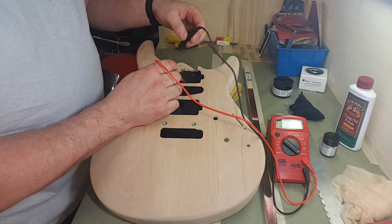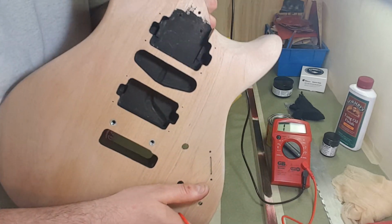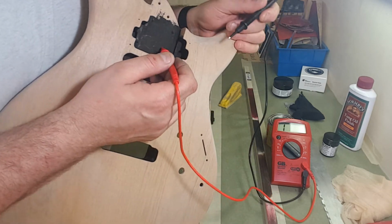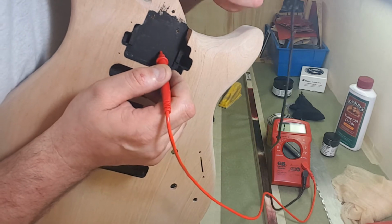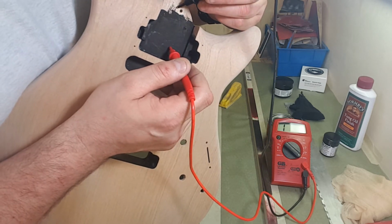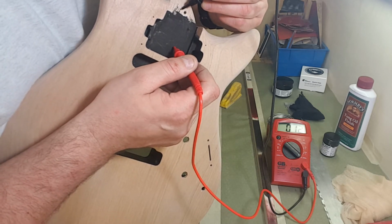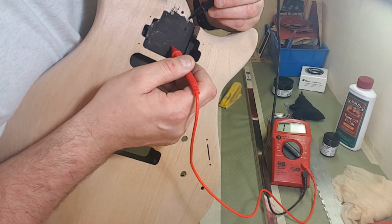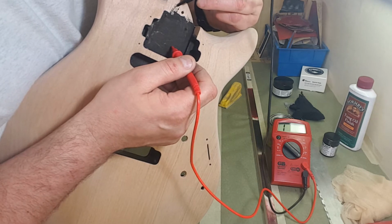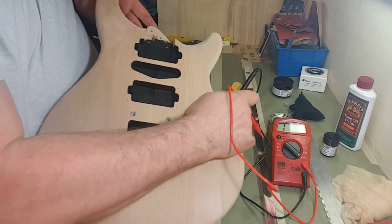And just to prove that this stuff works really good, there's a little bit of overspray, if you can see these little pieces here. So again, I'll just ground this out and watch the difference we have when we just touch. There is a little tiny bit of connectivity on this little spot, so we're going to touch just that little spot. There is some conductivity there, even though there's just a little micro piece, and the obvious parts that are disconnected have nothing. This line looks like it's somewhat connected. So if you have full coverage, this stuff is incredible.